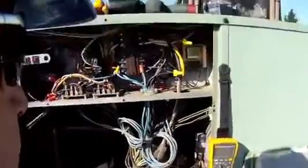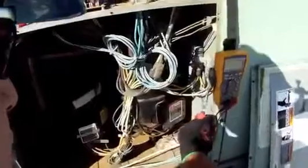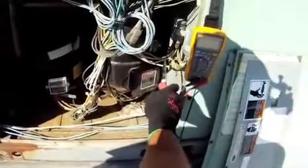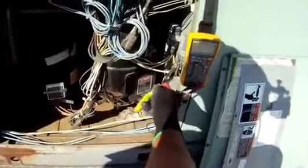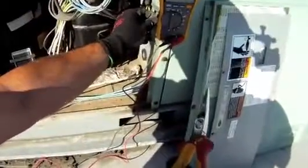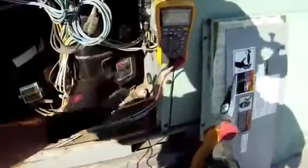I'm looking for brittle wiring and burn marks on the wiring or on the contactors. I checked those last month and I'm pretty content that this unit is in good shape electrically. All the connections are nice and tight — nothing that's going to vibrate off. This is the capacitor I'd like to take a look at. I'm going to take my meter — it's got a nice industrial magnet on it — and first I need to remove the boot that covers the electrical connections on this capacitor. Then I'm going to remove the spade connector from one side. Notice I'm using insulated tools. Even though this unit is de-energized, these capacitors are designed to store energy. So I want to dissipate that stored energy using my insulated tool by shorting across the terminals. That ensures there's no potential energy that can affect my readings.